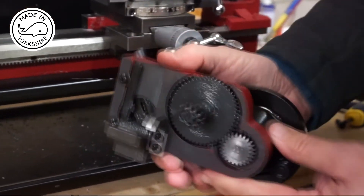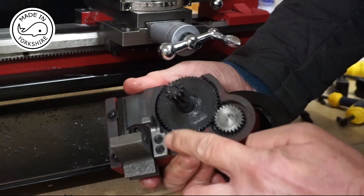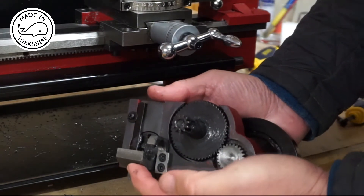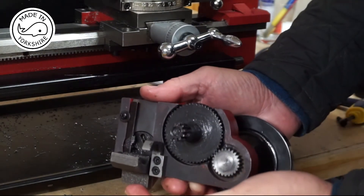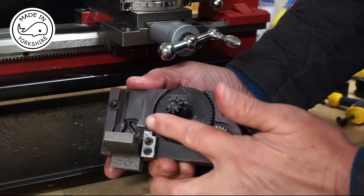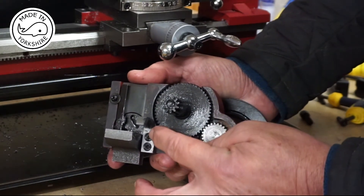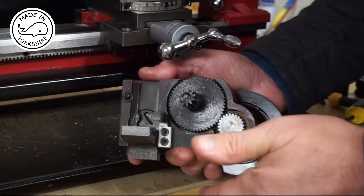And as you can see here, it's just got one half nut. What I found was this item here, which is the replacement for the normal half nut that goes on top. This enables the bottom half nut to squeeze against the lead screw. Without that, the lead screw would just move upwards somewhat, and I guess it would jump the threads when you were under power. What I found was that this particular item was too low down, so I just loosened these nuts off and moved it up slightly and then retightened them. That was causing all the poor movement when I was moving the hand wheel to move the saddle up and down.